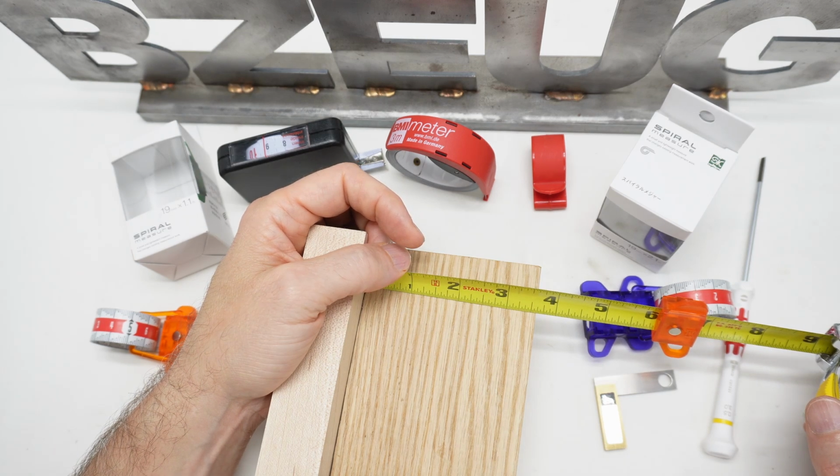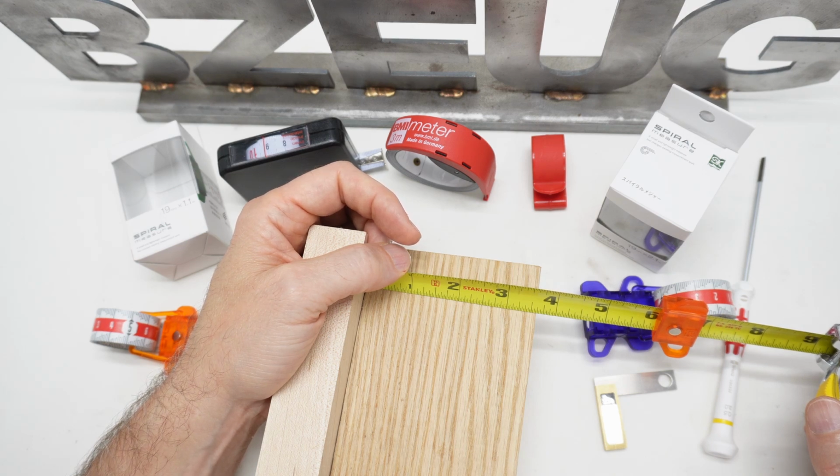So that's over 3.5, but less than 3 5/8. So it's not eighths, it's not sixteenths, it's 32nds. So it's 3 and 3/32 over 3.5. You got to add 3/32 to 16/32 because 16/32 is a half. So then you get 19/32. So that measurement is 3 and 19/32.